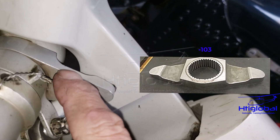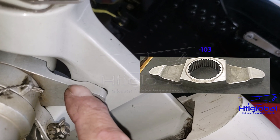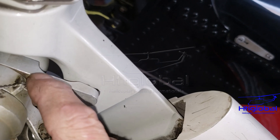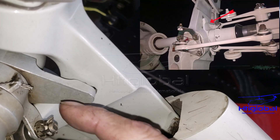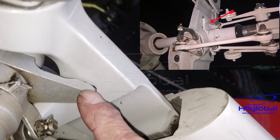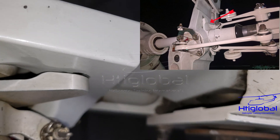This is the latest one — this is the dash 103 flapping stop. One important point of observation: you can install this backwards if you don't pay attention. If you look at this cutout here, this flapping stop can be installed by mistake backward with the cutout outside. If you look at it, you'll see a little angle that allows some flapping in the system.